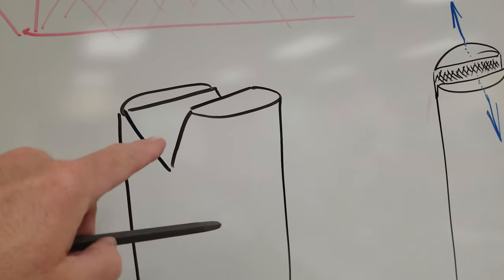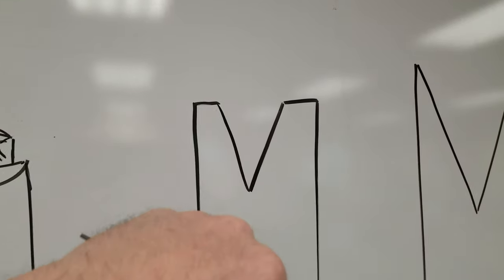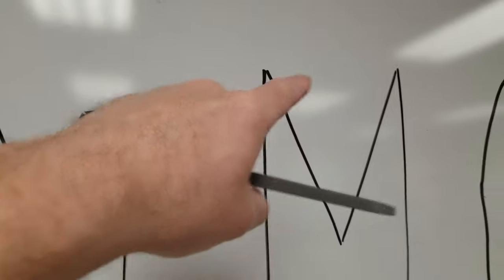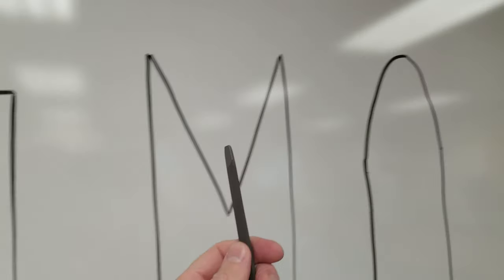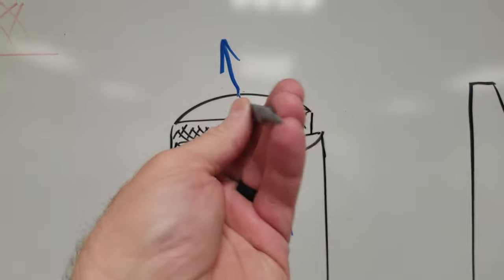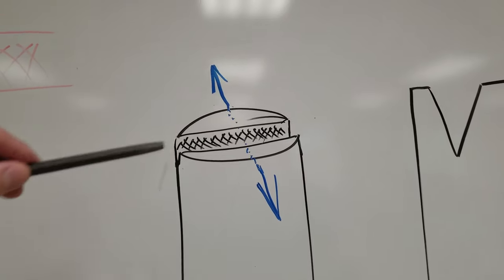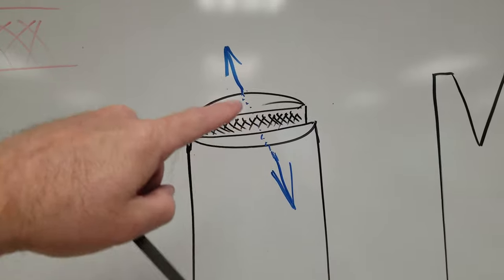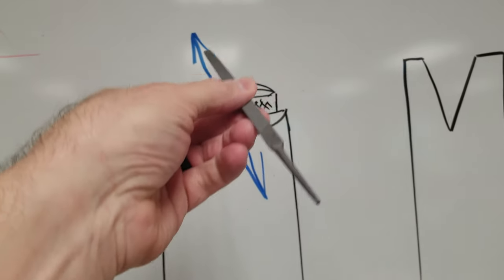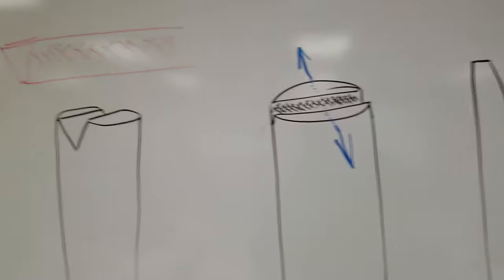This file size — I think this is a six-inch file — has serrated edges all the way up along this edge, so it's small enough to get down in there and make that cut. As you cut, just go back and forth until you cut a V in. You want the top of this to be flat. If you cut down too far you'll end up with a point at each end. From the side, if you rotate it sideways, when you make the next cut that cross cut is going to go right across here. It's really easy to hit that flat edge and hold it in place — if you're trying to make that cut across a tip it'll slide off and be really hard. So make your first cut, sand it down a little bit, keep enough flat surface on top so you can turn and start cutting the second side, and you'll end up with a plus shape with four little tips on top.